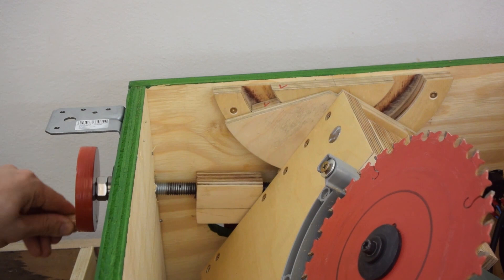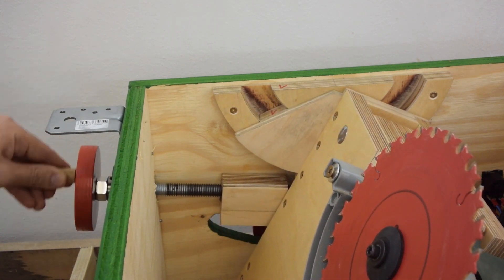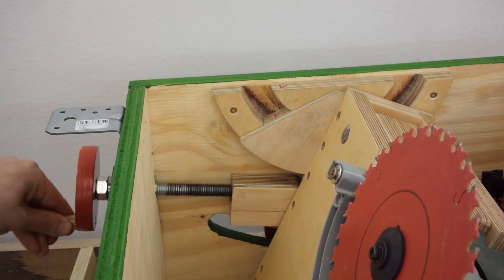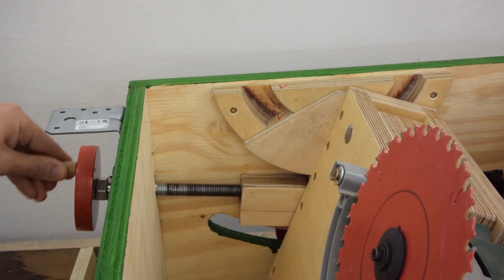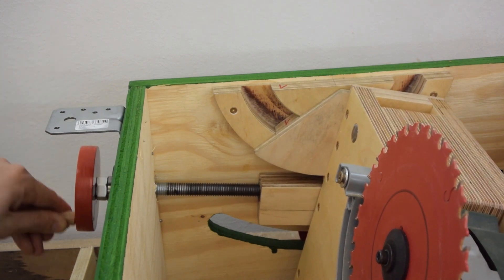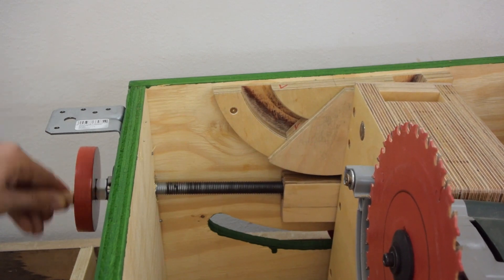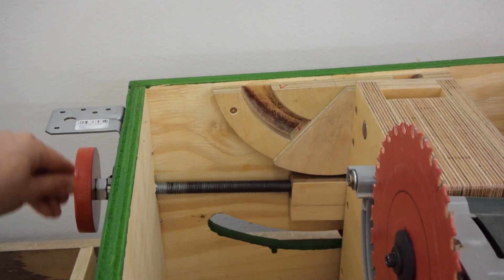The ratio between my cranking speed and the speed that the saw tilts at is dependent on the thread pitch and the length of the lever that the thread is moving. So if you just typed a comment about how I should really have used an acme spindle because with that threaded rod I'm obviously gonna crank away like a monkey — you're disqualified.